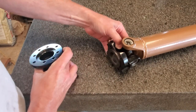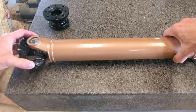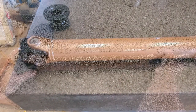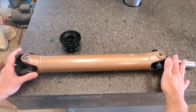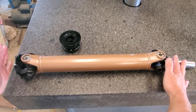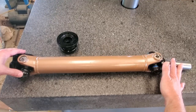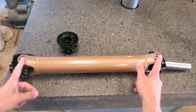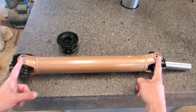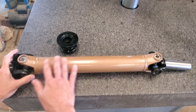So an upcoming project, as you can see, is this drive shaft. I can show you what we did there. This little drive shaft assembly adapts a Mustang T5 at this end to the Subaru differential, and this end is mounted to the chassis, so it's not a part of unsprung weight. That's just little half shafts out at the end, but you know, you're talking maybe 21 inches pin to pin here. So we'll do this in an upcoming video.